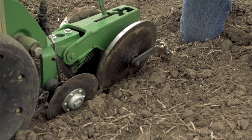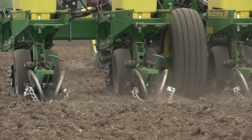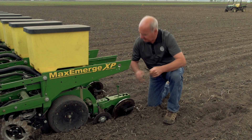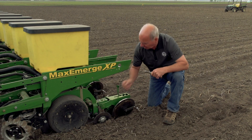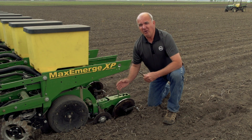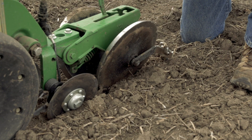So we spring-loaded each side so we have movement. We wanted to remain shallow because we understood how much down force it takes in a row to put a seed in at two inches — and then if we start putting a fertilizer disc in at two inches we're going to greatly enhance the down pressure needed. So being very cost-effective and simple and narrow and tight were some of the things we looked at.